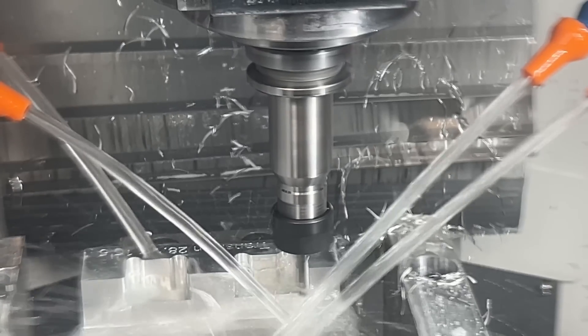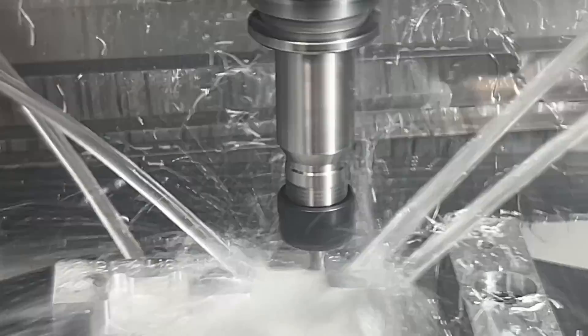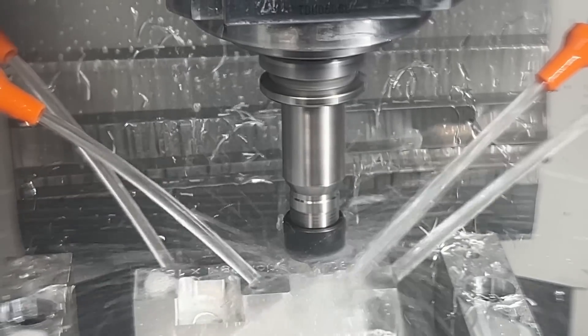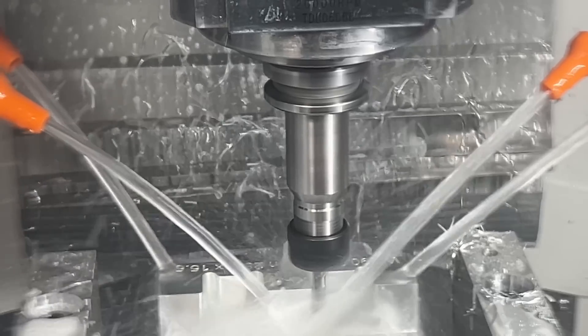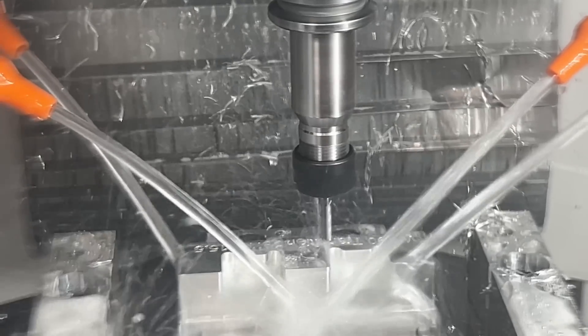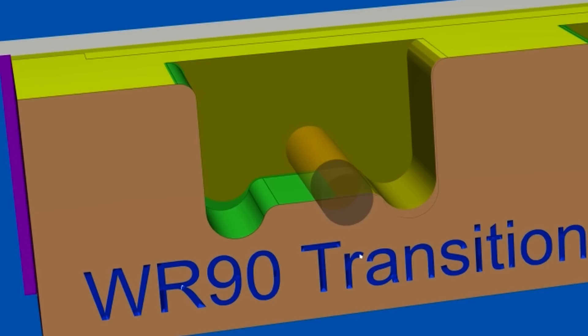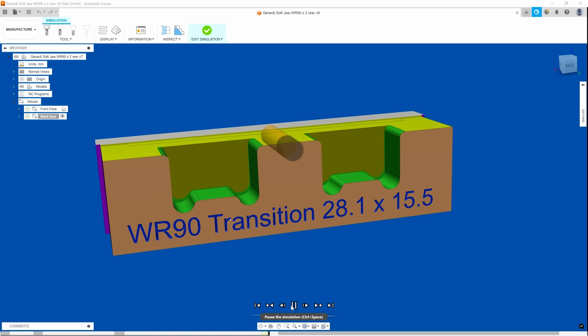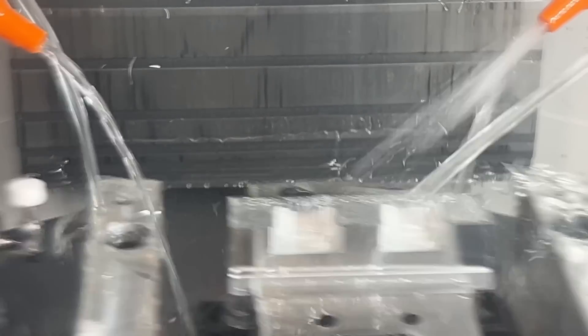So the next operation is a finishing cut using a contour path. It should leave a lovely smooth... oh. Well maybe that was just a one-off... Those pockets have only got about three quarters of a millimetre of clearance compared with the diameter of the cutter. I could have used a smaller cutter, made the pockets a bit deeper, or used more compensation to slow the cutter down as it went round those corners. Luckily it's in a completely non-critical area, so I'll just chalk this one up as a learning experience.